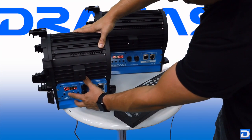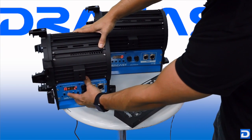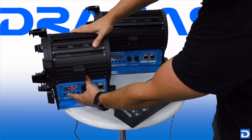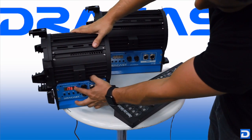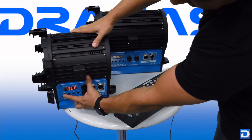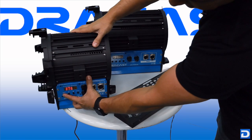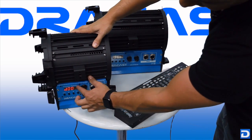You can go through slave mode, A-double-zero mode, A01 mode — there are a lot of different modes this light can function on. For our purposes we're going to focus on the intensity mode, because that's where we assign our DMX channel. So first thing we hit menu, and once we're on that home menu, we keep hitting menu until we come to D001.